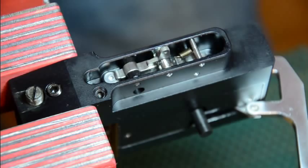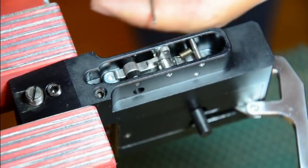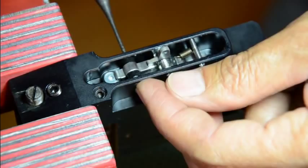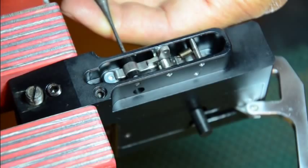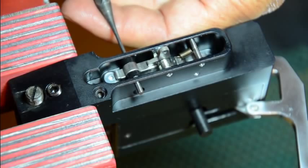What we need for that is a punch. The key point is you don't want to punch this pin out all the way — just enough so this pin will stick out and hold the last bushing. You gently pop it out and you see it coming out. Use gently now. When you push the pin far enough out, the shear will pop out.